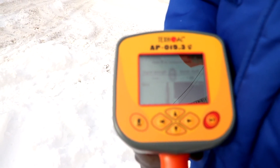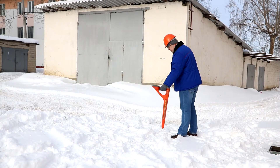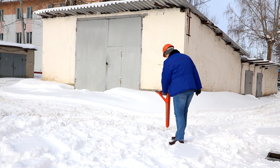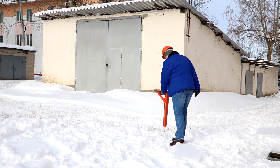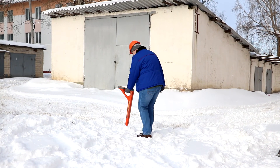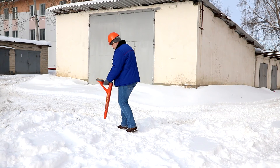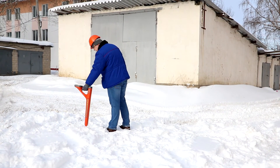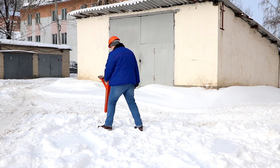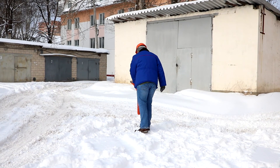We have to locate the ZONDE by observing the signal level. After you have located the ZONDE, all you need to do is push the pushing rod inside the pipe and locate the maximum signal. At the point of maximum signal you can measure the depth of the located ZONDE. All you have to do is ask another person to push the rod inside the pipe simultaneously with your location speed. This is how you locate the pipe with MAG 105 or with the set AG309MAG.